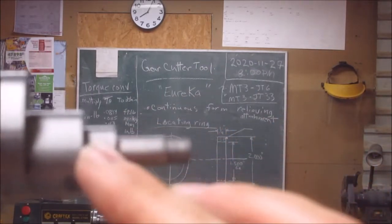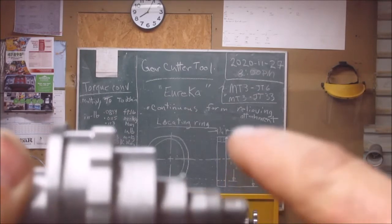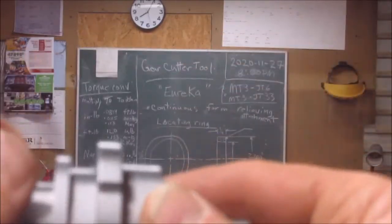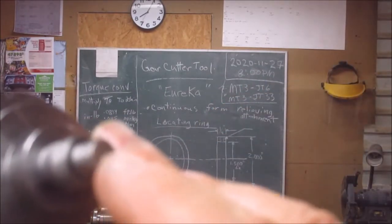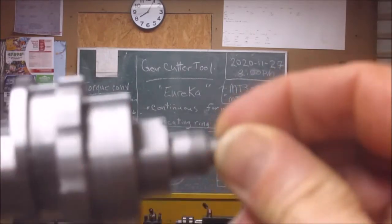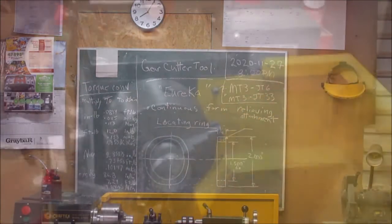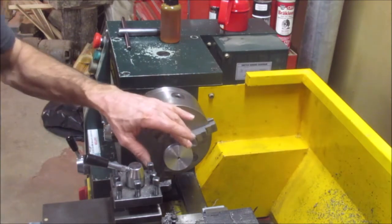The threads and the lobe here. Okay, that ring goes on here, and inside there is going to be the ratcheting system. So every time the lobe comes around once, click, it moves it once over, once over, once over. And this actually goes like this. Since the hole is not going to be in the middle here, it's going to be 30 thousandths off, it pushes it around in 60 thousandths increments. And that does the relieving. As it hits the cutter, it hits it in a way that relieves the back face of the cutting tooth. Okay? So I had a piece of leftover stock from the indexing.